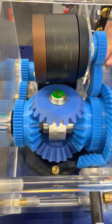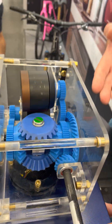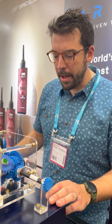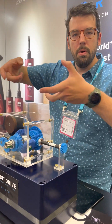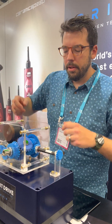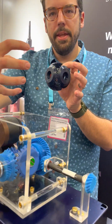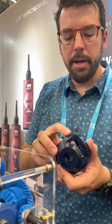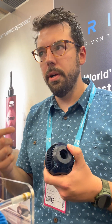One of the benefits of using the bevel planetary — which is very similar to a car differential — is that we're able to maximize the 3D space. Instead of just using spur gears, which would grow in every direction, in this case we're able to grow both in the axial direction as well as the radial direction. That way we can maximize the diameter and thickness of the teeth for higher torque capability, longer life, and so on.